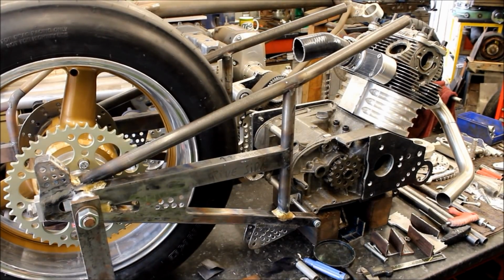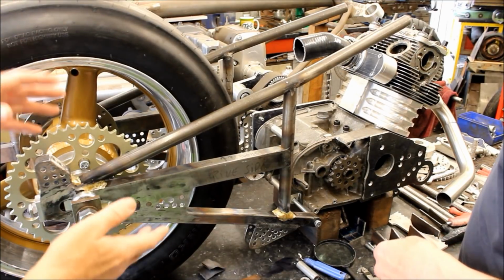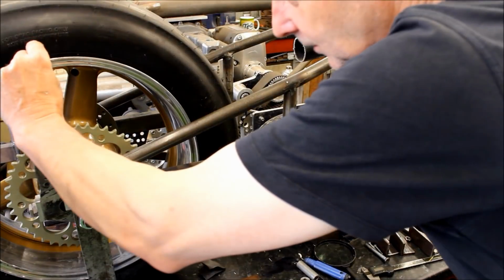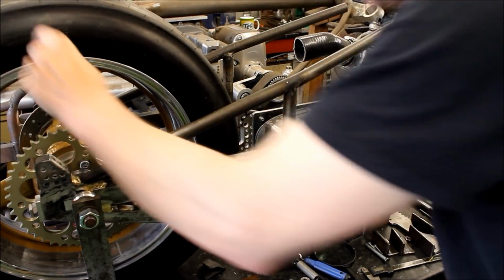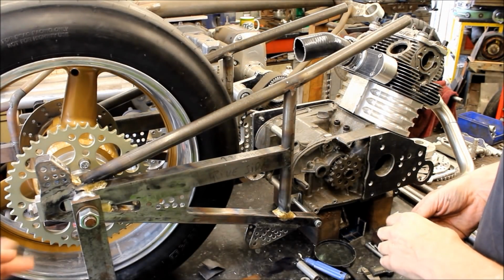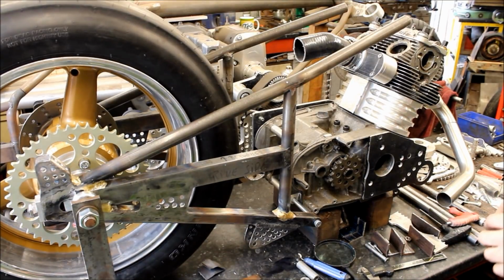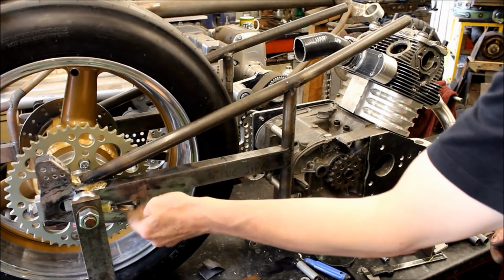Okay, so we're back looking at the bike itself. You can look at the back end in. As we said last week, the whole point of doing this is because this tyre is much taller than the old 18s. The original was probably there, and that there has lifted the engine far too much. So you remade this whole back end and brought this inch and a half up.